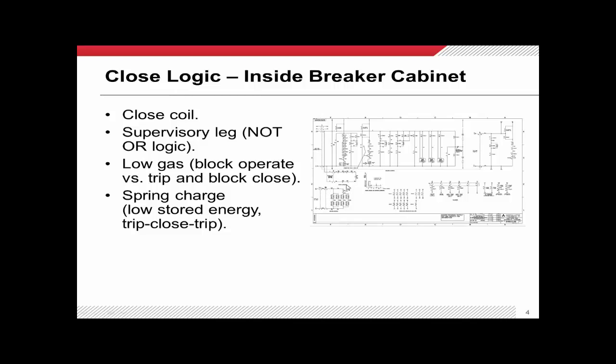We talked about spring charging and how a circuit breaker by its nature must have stored energy so it can operate within the required speed. Keep in mind there will be cases where we want to reclose after a trip, so without having to recharge the spring, you should be able to trip, close, and trip again at a bare minimum. The spring charging circuit is located here, and up in this area are protection features that supervise and check the health of that motor. We also talked about the 52B contacts and the difference between them and 52A — in all breakers and most control schemes, you need to know the status of whether the breaker is open or closed.